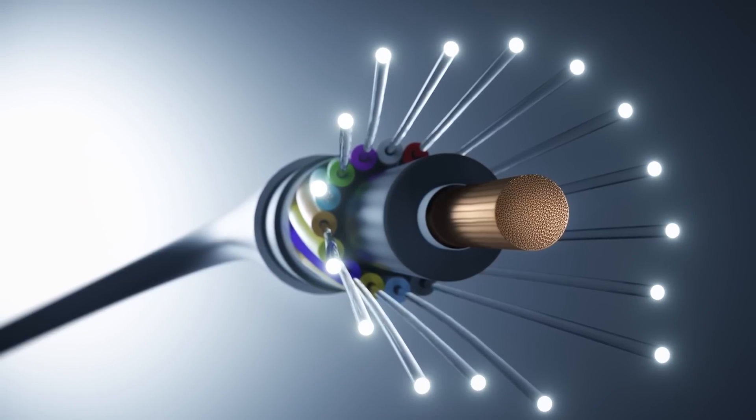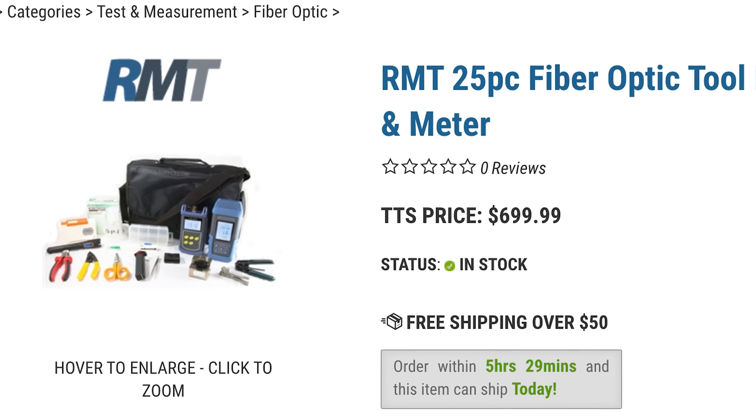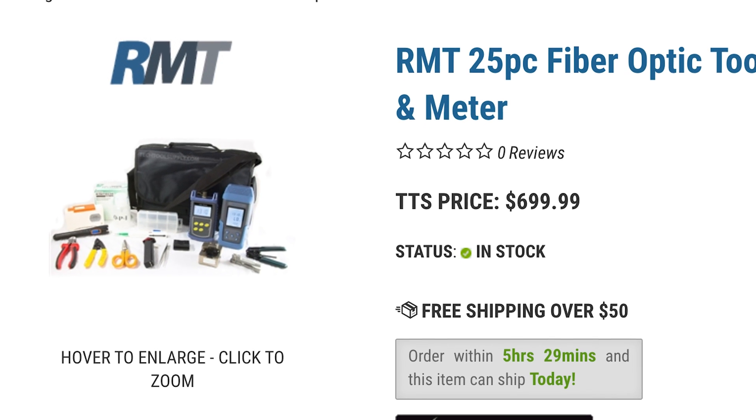The next option was fiber. That would work because fiber doesn't conduct electricity — it would run straight across the street with a really strong signal and I could bury it pretty easily. The only issue is terminating either side. Termination of fiber is pretty difficult because you need a fiber fusing box, and those are pretty expensive if you're only going to use it once. So I started counting that one out too.